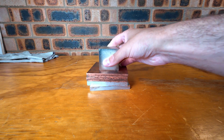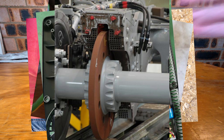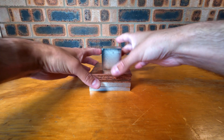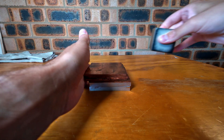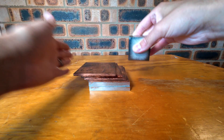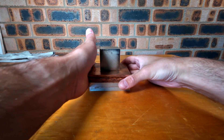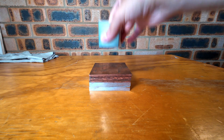Eddy currents are utilized in the real world for a number of things such as metal detectors, induction heating, electromagnetic cookers, and my favorite — electromagnetic braking — which is obviously what I've been showcasing today. Magnetic braking is used in some trains and roller coasters to slow down rather than using friction braking. With friction pads, that creates a lot of wear and tear. But with magnetic braking you don't need to contact anything. As you can see, as soon as I run the magnet over, I feel like I'm hitting something — like pushing it through syrup. There's no contact, so no wear and tear can actually occur with this form of braking. It's quite a genius invention.